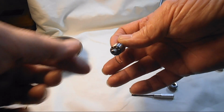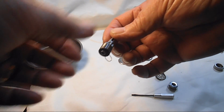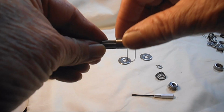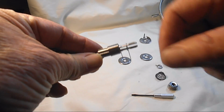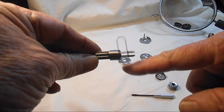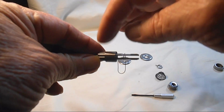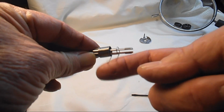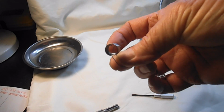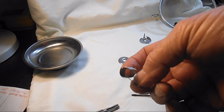And if it's gone, let me move the tail away from there. Oh, I can't move it that way. Let me move it back this way. If that tail can't get in one of the grooves, it'll just spin. So on the machine, it might just flop up and down by the thread, but you're going to lose your tension because there's no coil effect. Once it's on there, you get that snappy, springy effect. So watch out for that little tail that tucks in there.